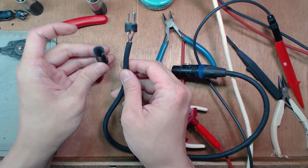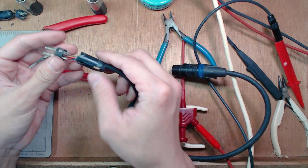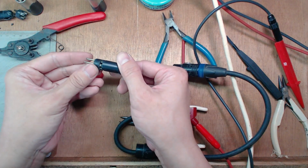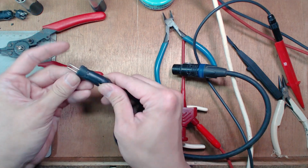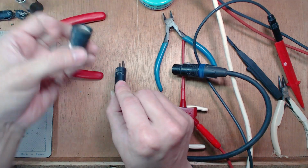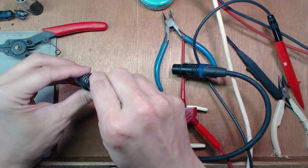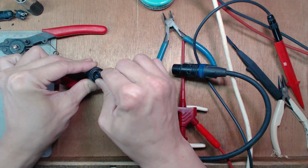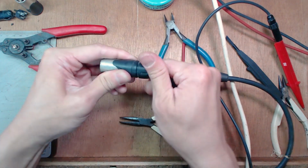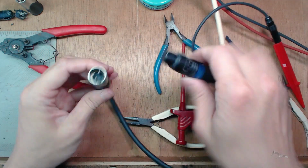Same procedure, go get the chuck, the cable clamp, slide it through. There should be a guide. In this case, for Amphenol, there are guides over here, right? And same thing, on the male connector, there's usually a notch of some sort. And then you can eyeball down the barrel of the casing and line up the notch. Yep. And it should slide through. Pull the boot, twist. As tight as you can, and that's a good connection right there.